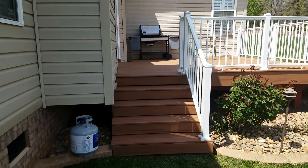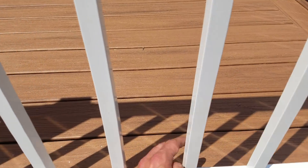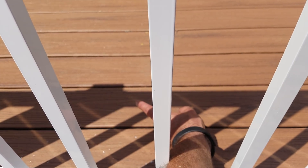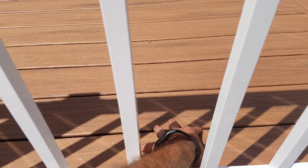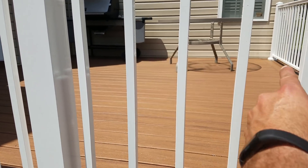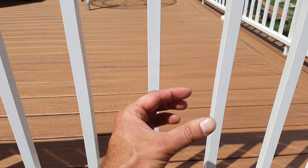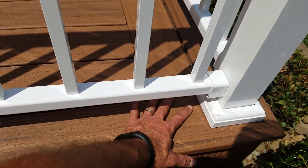It's just those deck boards take time. You put your clips in, get somebody ready to drill, then go down to the next joist with a hammer and chisel or spike, drive it in and pull so the board comes in tight. The spacers keep your gap consistent, but if you squeeze too hard it'll close up. Measure about every five boards — right, center, and left — so that when you get to the end you don't have a board that's not straight. If your measurement is off an inch, just start opening or closing the gap on whichever end to slowly fade back to the correct measurement.